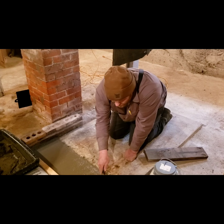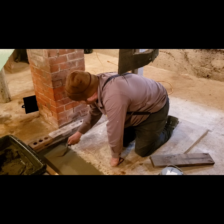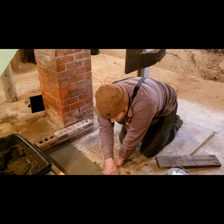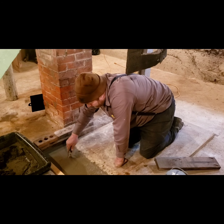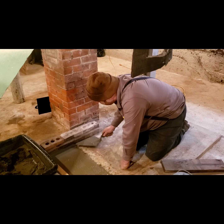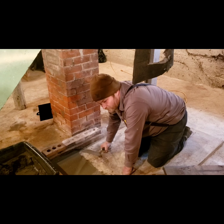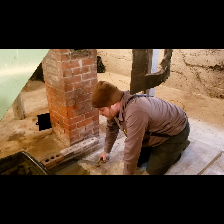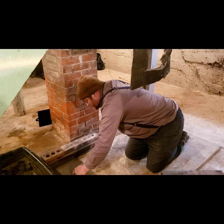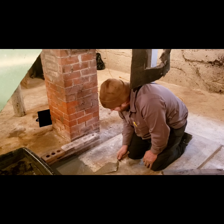And the squirrel cage or fan motor in this has been disrupted or compromised. So rather than have the fan run all the time, that's not going to help your electric bill any. We're just replacing the whole furnace because of the age. The motor won't start on its own. If you kickstart it, it'll go forever. And we were going to switch it anyway. So we got by while we could with it.